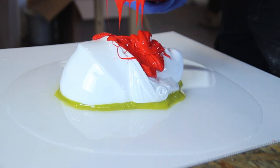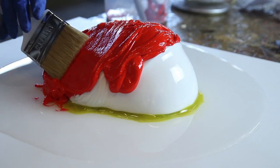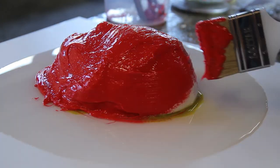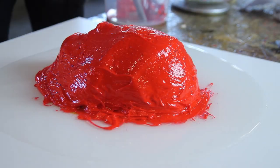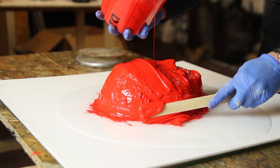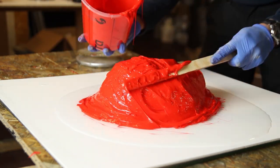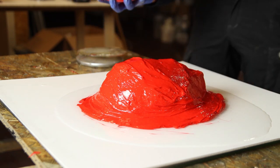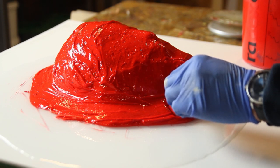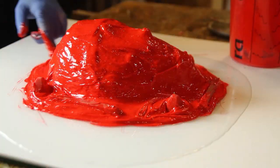It's now more like cake batter or thick chocolate, so you have to move it around over the mask. The advantage is you can now add thicker layers. I've added some red colorant to the silicone — a special additive so you can see where you've already been and where it's still too thin. On the chin I add a bit of a draft to make the shell easy to remove, with no undercuts. Then I'm adding some positioning pins so I can correctly locate the silicone sleeve into the shell later on.